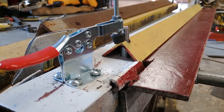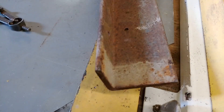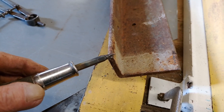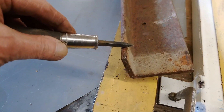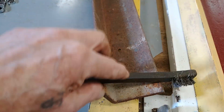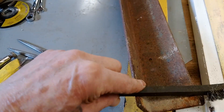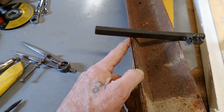You'll see what I'm talking about if you just take a look at the end of your angle. Okay, here's what I made. If you leave everything the way it is, you're going to have a radius on your metal, because this here is a radius. What I did — I ground this here down. I ground it this way, so it's the same plane across there. Basically I had a big belt sander and I brought it right across there. That puts an edge on here — that will give you a sharper edge.